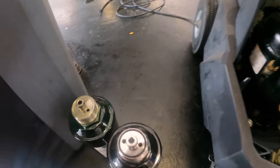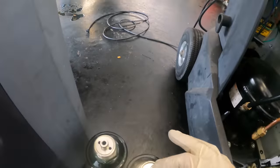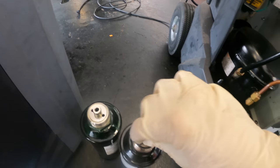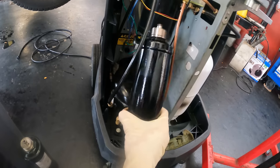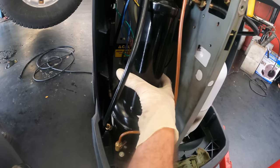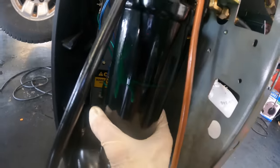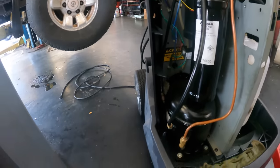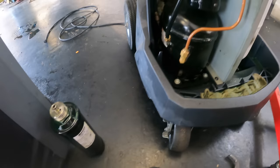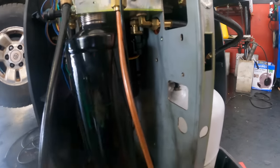I think what I'm going to do is just go ahead and install this unit, brake-clean all this dye off, and recheck it in a week or so to see if it's got any leaks — because I'd rather not pay someone to come out here and service this machine when I may have just fixed it. I am wondering where exactly that O-ring went — it should have been installed on this filter last time the filter was changed. Who knows, stranger things have happened.